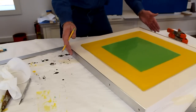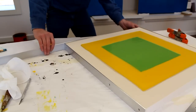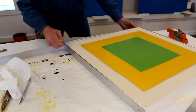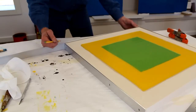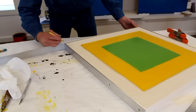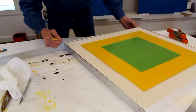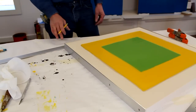Once I have the strips of aluminum attached to the top and the bottom, then I take my side piece and mark it so it's flush. And the reason why I do that is you're never really looking at a painting from top or bottom. You're usually looking at it from the side or straight on. So this way, you're not seeing any of the end grain, you could call it, of the aluminum coming this way. So then you just see the nice, clean edge. So I'll bring this downstairs, cross-cut it, and then I'll show you how I drill those holes.